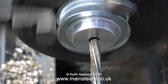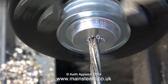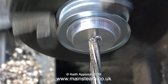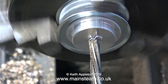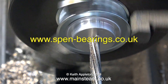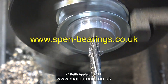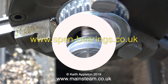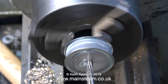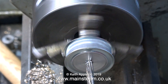How can this be? This is modern CNC technology, but these parts are very cheap. I'm going to ream them anyway, and after reaming and mounting the part on the engine's crankshaft, if it's still not concentric I'll put it back in the lathe on a mandrel and lightly re-machine the external part of the pulley. I bought these pulleys from a local company called Spen Bearings and I've just phoned them to ask what's going on — I'm currently awaiting a call back. These parts were very cheap so I'm not really complaining; if I have to re-machine them to make them accurate, that's not a bad thing and I'll make a video about it anyway.